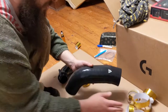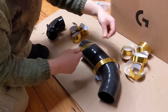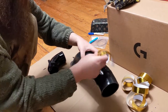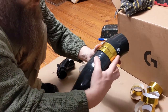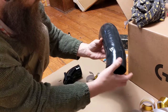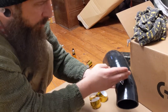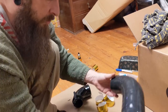Now that we are all set, our tape is ready and our pipe is ready. The way we are going to tape it is our own method, but we obviously need to create small overlaps. The way to create your overlaps depends on which way your pipe is going to be aiming. The general rule is: if your part is pointing that way, you start taping from the back of the part going forward. That way each piece will overlap the one behind, and you will still get little lines but it will be a lot smoother.